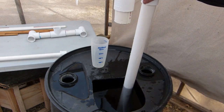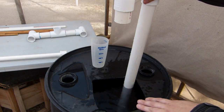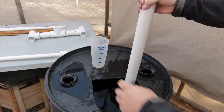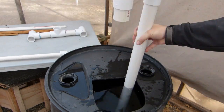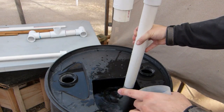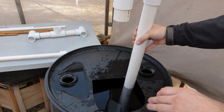These pumps have to be used at a certain depth. You've got to have close to a three-foot depth for it to pump like this. If I pull it up just a few inches, it won't pump this barrel all the way out — it'll pump this barrel part of the way down and just stop.